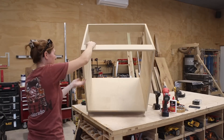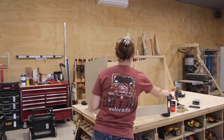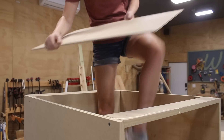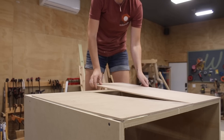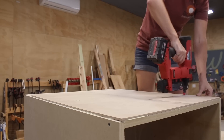All right, with that attached, let me spin this around, tilt it up, and just like that, we have a cabinet. Oh, well — I forgot the back. Let's just lay this thing back down, but this time laying it on its face. I made the back from quarter-inch MDF, as it doesn't need to be super thick. Quarter-inch material will do a great job at holding it square and keeping it from racking. You'll see that my back is in two pieces — that's because I'm using scraps and don't care if there's a seam.